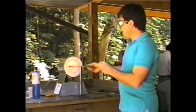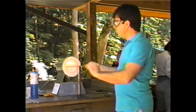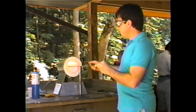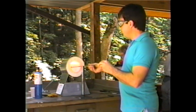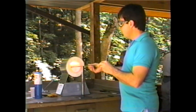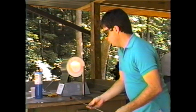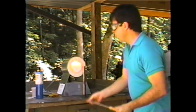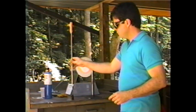There are two ways to add shape to our canes. One is to add shape while we're manufacturing the product. The second way is to pull them straight and then shape them later over a torch. I'll demonstrate one method of shaping the molten glass while we're working it in the glory hole. We're going to use our square stand to form a spring type shape, which can later be broken into smaller segments.